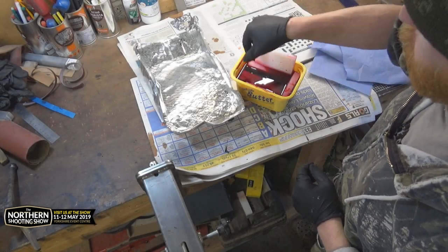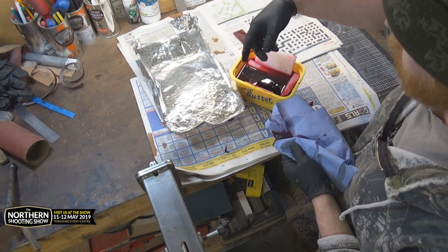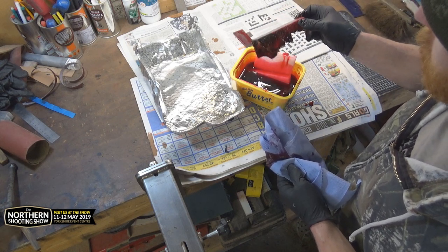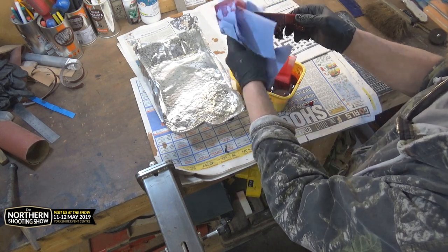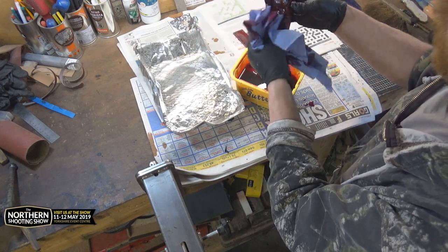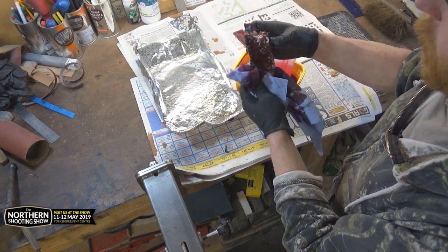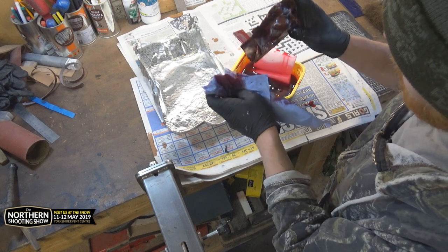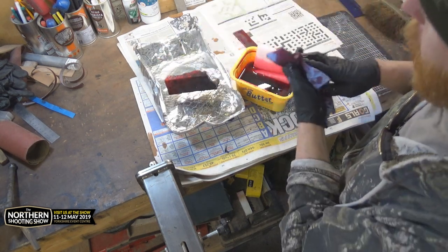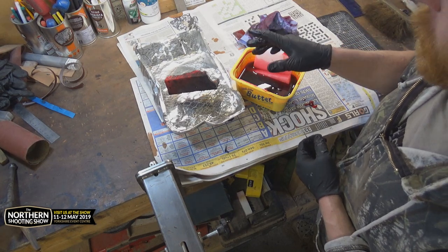I've got the block out of my pressure pot and I'm just going to get rid of the weight and wipe it down a bit. The block's out — let's see how it turns out. Yeah, that doesn't look too bad. Now usually if I've just got a normal block I'll wrap it up in tin foil and then put it in the oven, but from what I understand you don't need to wrap it up in tin foil — it's just to help the resin from escaping. So I'll get rid of this excess. I've got a bit of wire on top of a tray so I'm just going to leave it on that, so any bleed out from the wood will just drip straight into the tray and won't cause a problem in my oven. I'll get that in and baked.